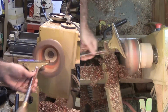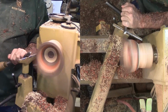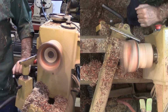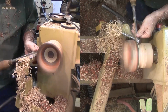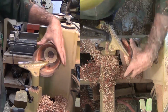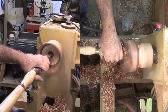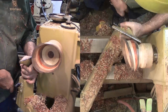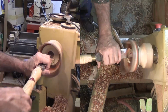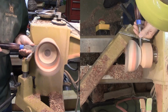With this adaptation, I continued to shape the bowl, alternating between the interior and exterior to get a shape that is pleasing. Then a whole lot of sanding. I had to sand with the lathe stopped, which is especially difficult for the interior, but I'll spare you the sanding. Next I'll part it off, but that's not the end of my problem.